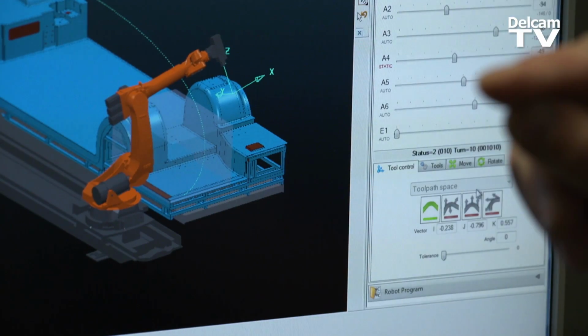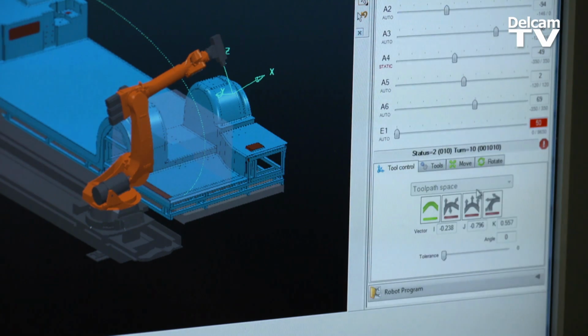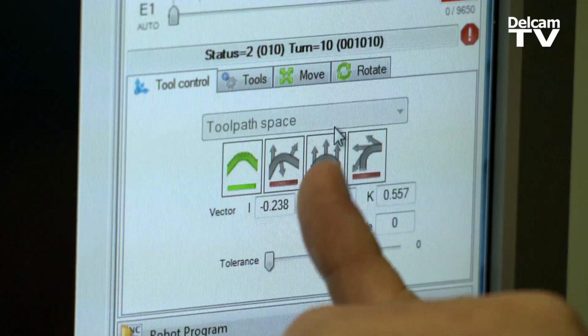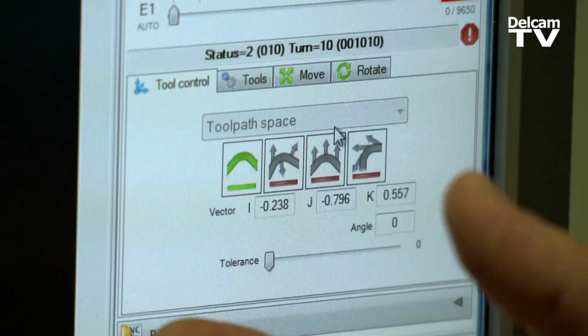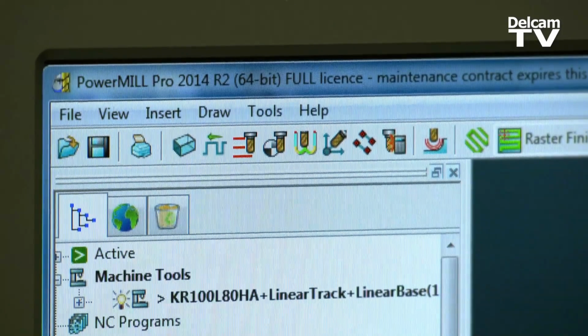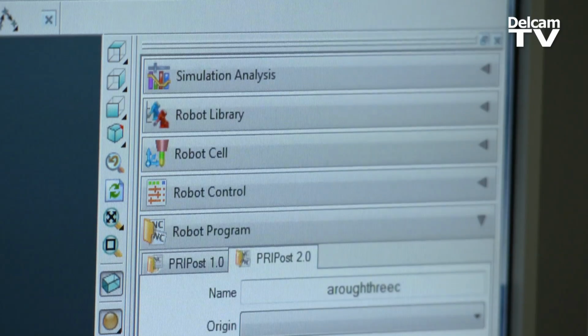We do milling, but we also do spraying, wire cutting, and other operations that need vector control. Because of these controls, I'm able to use it for applications that aren't point dependent. I was using SurfCam at one time. When I started the process of integrating the robot, I looked at Unigraphics. Other packages just couldn't manipulate that data and machine and program in an efficient manner.